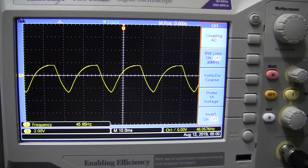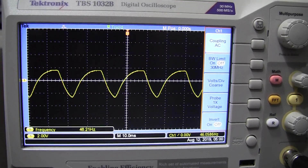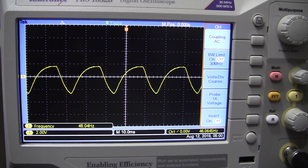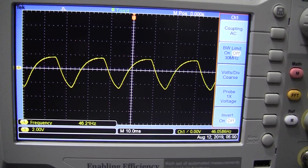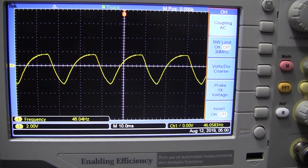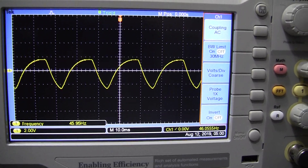There's the waveform for JAD Electric's 555 circuit. Notice that the low pass filter is producing quite a good sine wave. Listen to the low tone in my speakers and observe the frequency there on the screen — 46 hertz. Excellent job, JAD Electric.